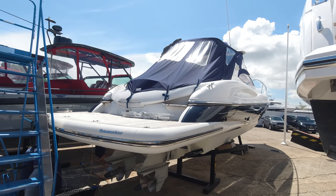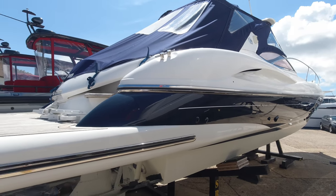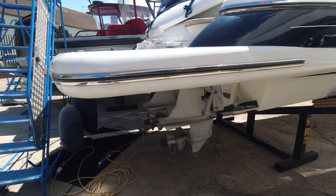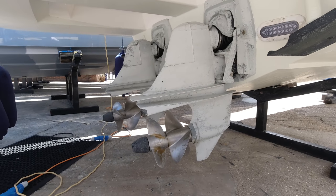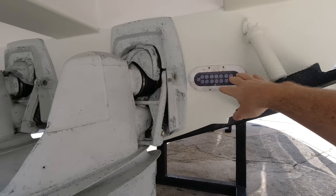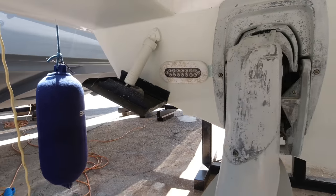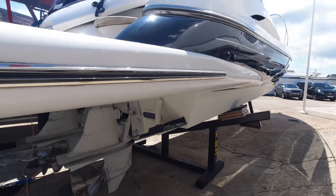It's really all about what goes on in the cockpit and the engine bay. These are effectively a Sunseeker Superhawk 34 hull which is modified to take this extended bathing platform, giving more space for connection with the water for diving and carrying tenders. Powered by a pair of Volvo DPH stern drives with stainless steel duoprop propellers, and on the back we've got Bennett hydraulic trim tabs. A pair of underwater lights, and fresh bellows here on the drives so they're pretty much ready to go. The hull's had a fresh coat of antifoul so it's suitable to leave in the water for the rest of the season.